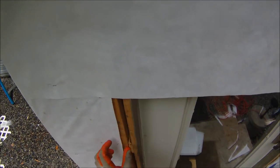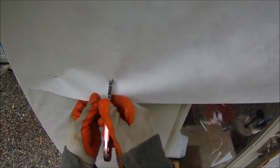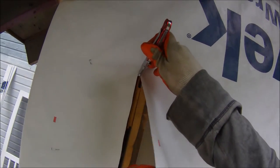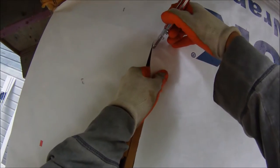For doors and windows, you generally just Tyvek over them. Take a razor and cut — you want to leave a little piece of the wood because your flashing tape needs to make contact with both the Tyvek and the wood. Follow the line you already have. Sometimes your razor gets dull — flip it to the other side. If you're not sure where the hole is, cut a little smaller; you can always take more off later. If you do mess up, use Tyvek tape to patch and reattach it.